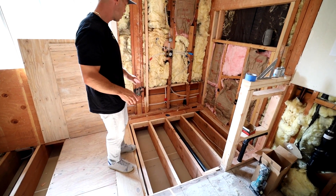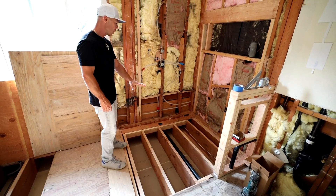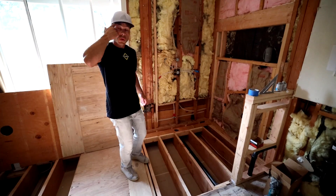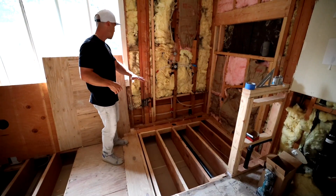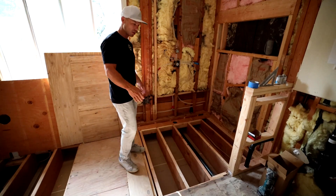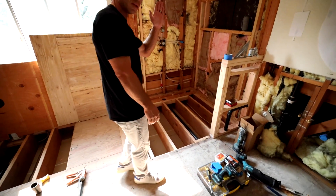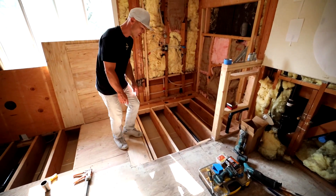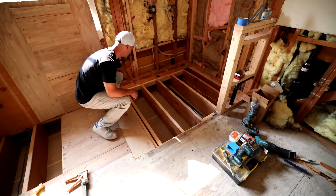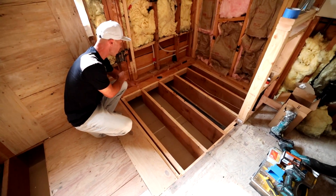In this instance we are really close because this is the exterior wall of the upstairs, but these floor joists actually run out another six feet. The roof line is here and then the wall jogs back. So the center point of our joist is right about in here. We couldn't just notch into here — we had to taper. So we started at zero right here and tapered down these floor joists to this end, where now we're in the outside third of the joist and we can take out more.